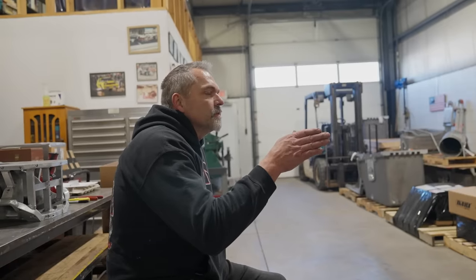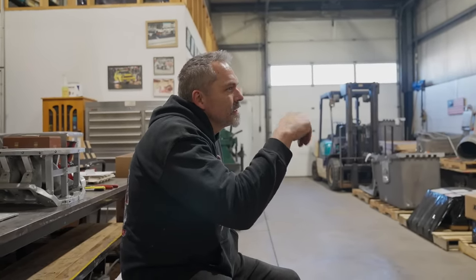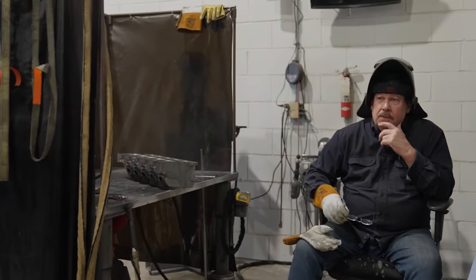So when that frequency is so low and then my cup was so big, that's why I'm getting so wide and so big, and my heat was all wrong and it balls up wrong. So yeah, I'm excited to whack my frequency all the way up there. Yeah. And then get that smaller cup. Now, because it always wants to build up, I understand what was going on now.